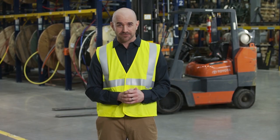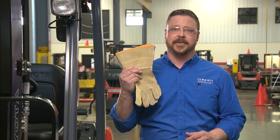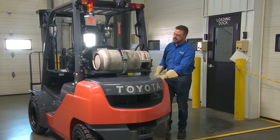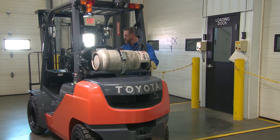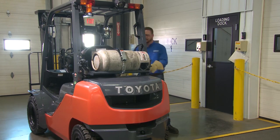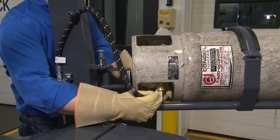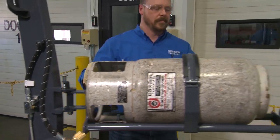Let's see an LPG cylinder swap in action. I have the unit parked with the engine running and my protective gloves on to protect my hands from liquid propane freeze burns. Close the fuel line valve on the cylinder and let the engine run until it stops — this guarantees that the connection hose is empty of propane. Then shut off the ignition, disconnect the hose and the holding straps, and lift the empty cylinder off.